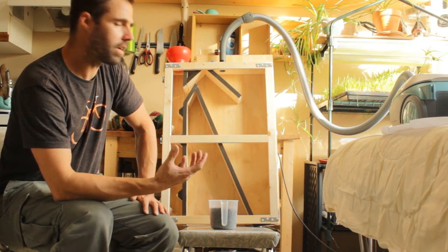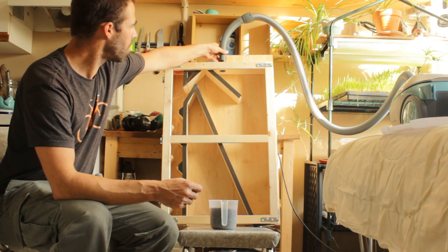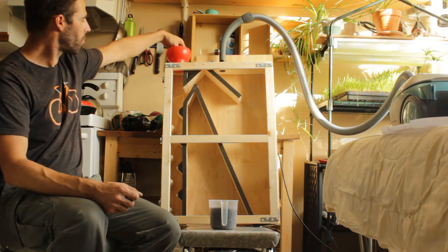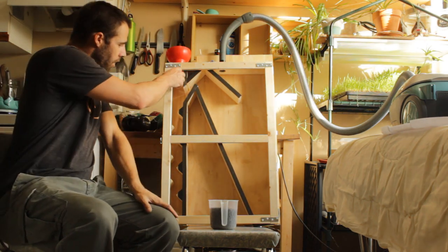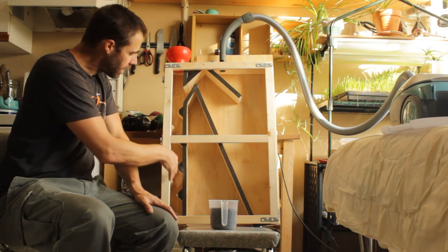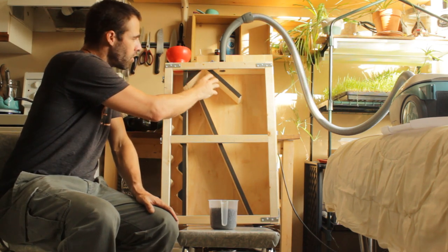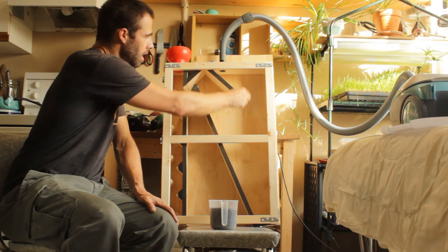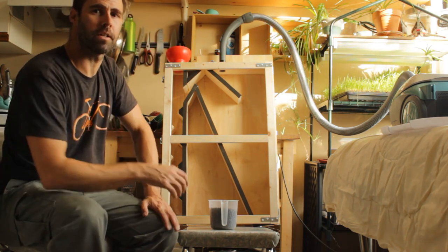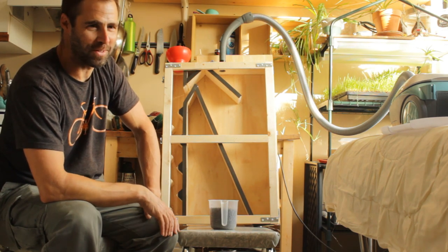This is a seed cleaning mechanism based on suction or airflow. I've got the vacuum plugged into the top and it's going to create suction and draw air in through here. What I'm going to do is drop the seed in here. As the seed falls through, it bounces off these baffles which keeps it in the centre. The lighter seed gets drawn up, then as it passes through a narrow passage into a bigger passage, the air pressure drops and it falls down here instead of getting sucked up.